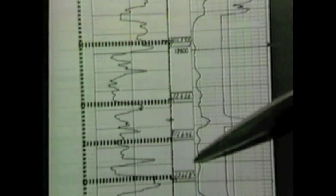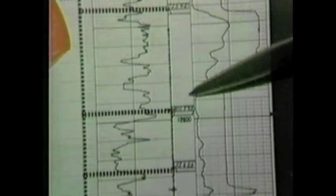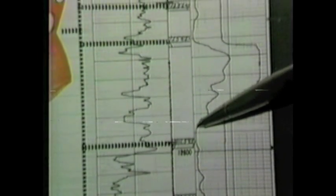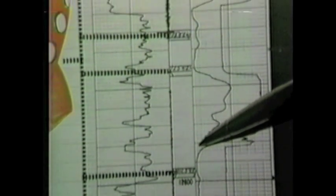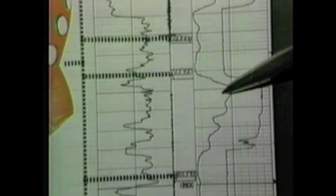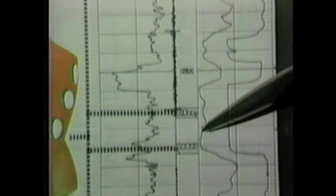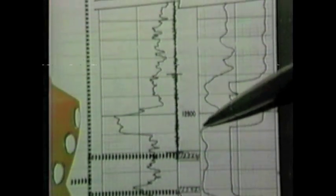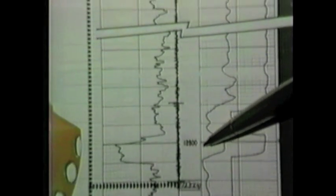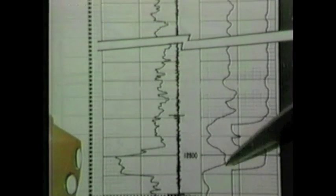These are our turbulators right here. And then we skip a joint right here. As you can see, we go about 15 foot and go back into a channel. It comes on out here until we come to our next turbulator right here. Comes back into a good bond to here. And again, it shows about 15 to 20 foot above it — good bond. And then it goes back into that channel again.